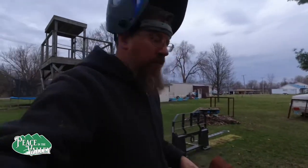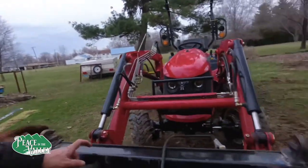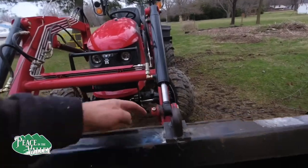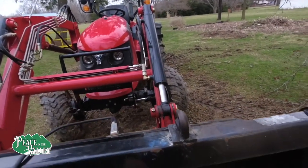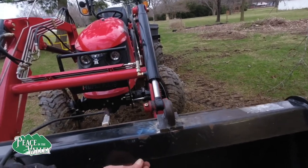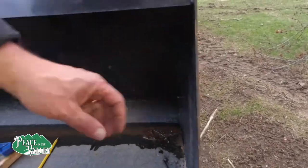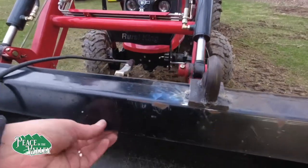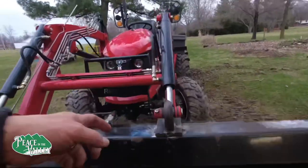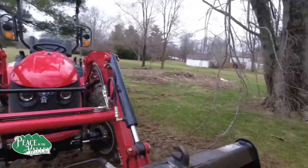I think we're gonna turn the power down a little bit because the metal on this part, not this part, but this part, is not as thick. In fact, I think that's the thinnest part. It feels like it's less than an eighth of an inch. This is probably an eighth of an inch right here, and this is probably a 16th, maybe a little less. So even though it's reinforced up underneath, we want to probably turn down the power a little bit.